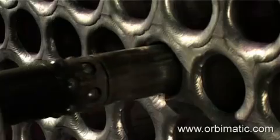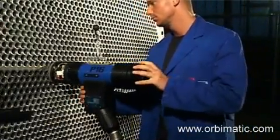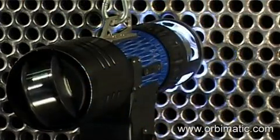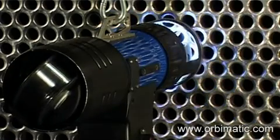The power is transmitted using a top-quality silver multi-disc coupling. The weld head is centered by using exchangeable mandrels, which guarantee fast deployment and shortened setup time. The P16 weld head is equipped with a standard 1kg wire spool which turns coaxially with the torch, ensuring that the wire moves into the weld pool without spinning.